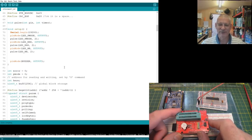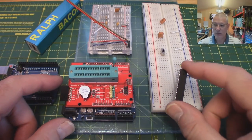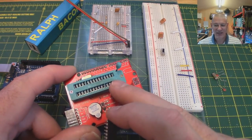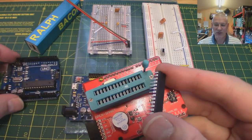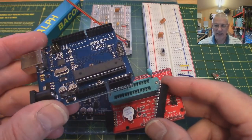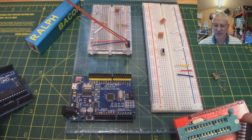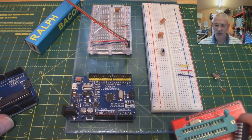Let's go and do the demo. I've pulled that chip from the breadboard and we're going to put it in here. This can obviously only be used for chips like this which are on Arduino boards with a DIP package. I mentioned in a video or two ago that it's highly unlikely you're going to get a board like this anymore - you're more likely to get one with a surface-mount ATmega328 in the middle rather than a DIP chip like this.